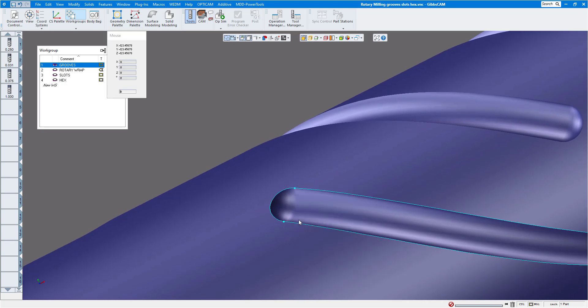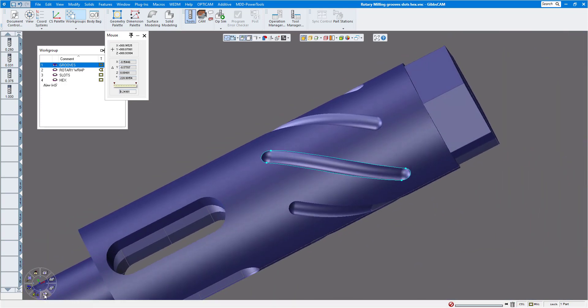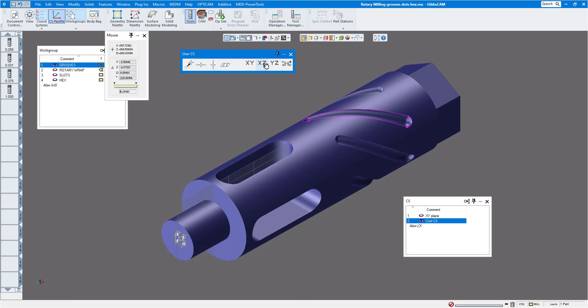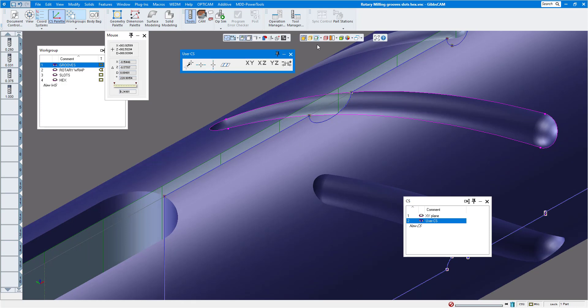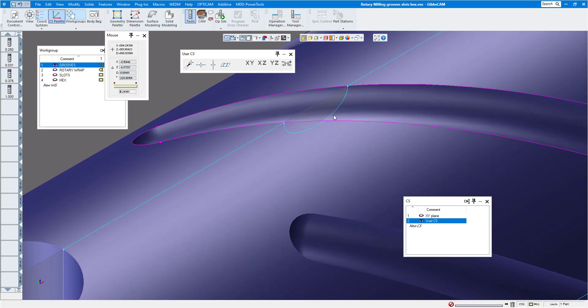Using mouse position, I'll click two points and I can see it's 0.2498 — basically a quarter inch. I'm not sure if it's exactly an eighth of an inch deep, so let me verify. I'll create a new coordinate system, go to the XZ plane, bring up the profiler to slice through the part, and extract the geometry off that temporarily. Turning the profiler back off, you can see the slice is right through the bottom of the groove.